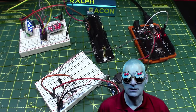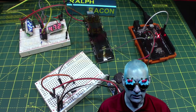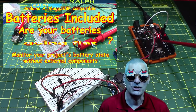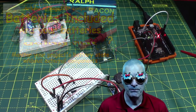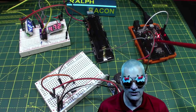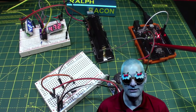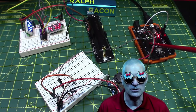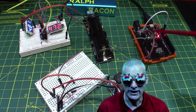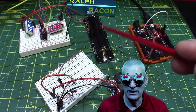This question was raised by Jess, a subscriber. She said she watched video 160 where I described how to use the internal AREF — a fixed voltage generated by the Arduino. She said okay, she can do that, but of course the five volts coming in, or whatever voltage the buck-boost delivers — 4.9, 5.1 — it's not critical. That's fine, it detects that. But of course what it's not detecting is the state of the lipo.